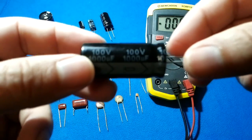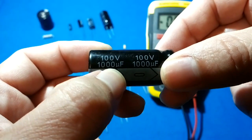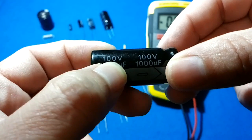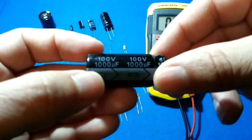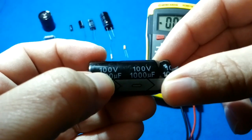When you need to replace a capacitor, what is important is to replace the same amount of capacitance in microfarads. The voltage could be the same or higher if the mechanical structure fits in place. So remember: capacitance must be the same, voltage could be higher or the same.